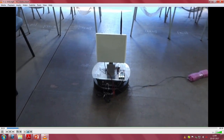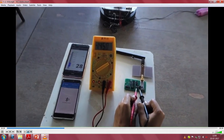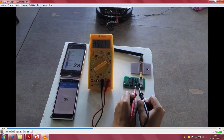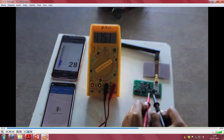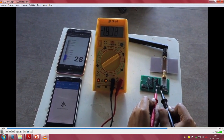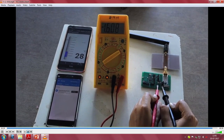Okay, so here is an RFID reader that you see here, which is throwing RF power on this antenna. This is a quarter wave match antenna, an impedance matching system, and the chip is right here. You see the voltage being read there. You see nothing now, you will quickly see something, yeah, there you see, you get some value. The value of the temperature also has changed.